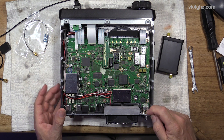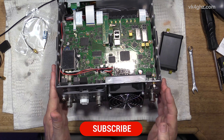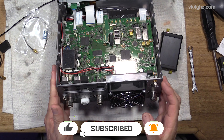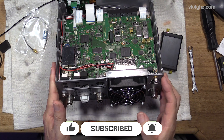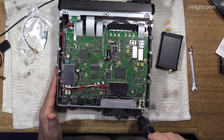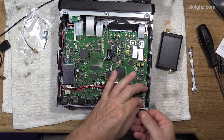I was unscrewing this and this SMA was a little bit reluctant to come out. You just don't want to bash it with a hammer or anything — you want to protect the thread. So I've just screwed on one of these SMA terminations, and just with a light tap with the screwdriver that loosened that up. So now we can remove that.